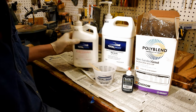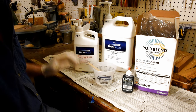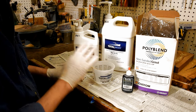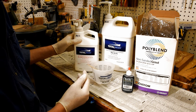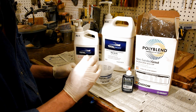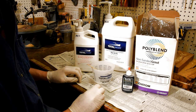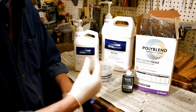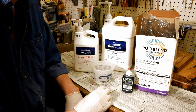Now it's time to mix up the epoxy. I'm going to use Total Boat — they have a high performance epoxy which is perfect for this. It flows really well and dries extremely hard. It's designed to be used as a glue, with fiberglass, and to build boats, but for woodworkers this is really a go-to for just about everything you do with resin. I like using the slow hardener — it flows really well and gives everything time to flow into place before it hardens. It takes longer but it works so well I just stick with it. I like to tint the epoxy black, as it looks like good thick spalt lines and doesn't draw the eye or look fake.